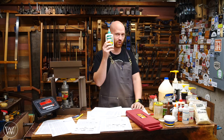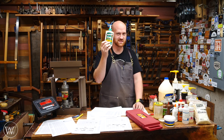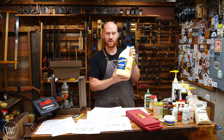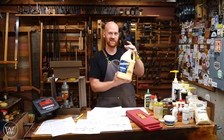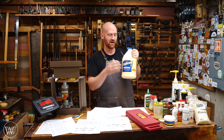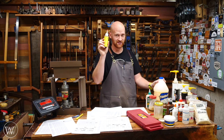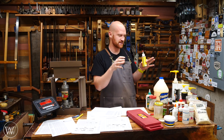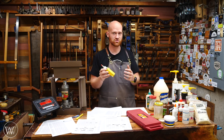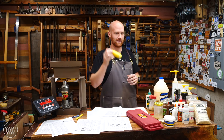Titebond 2 or Titebond 3 is a phenomenal glue for long grain to long grain. If your joint is even slightly good, even if it has some gaps, this is the glue you want to use. I'm going to continue using Titebond 2 as my primary long grain to long grain glue — number one because I can get it in gallon jugs affordably, and number two, it's right up there with all of them. I'm not having to mess with epoxy. Right behind the PVAs, we have Old Brown hide glue — really good glue, not quite as strong as the PVAs, but still significantly strong.